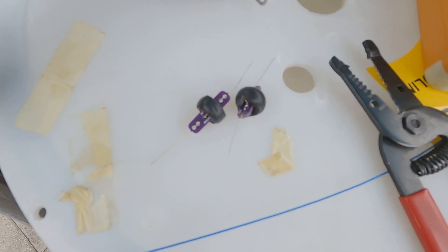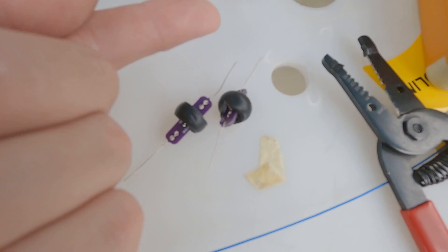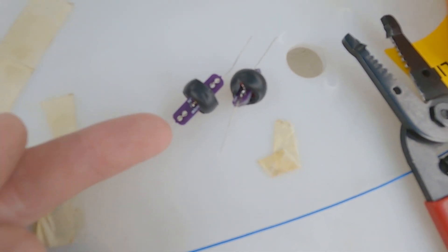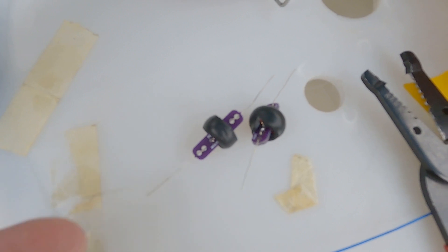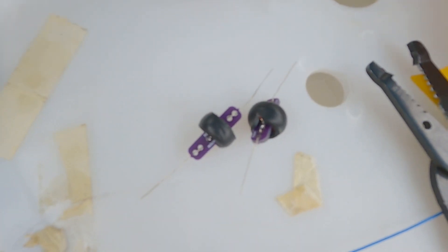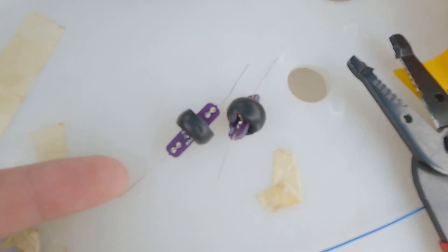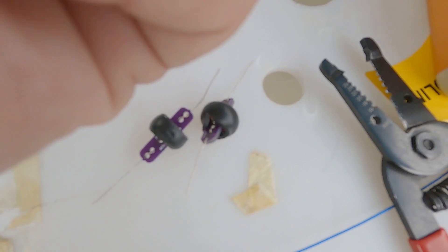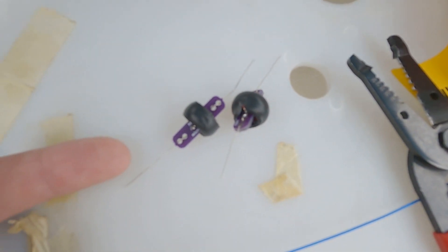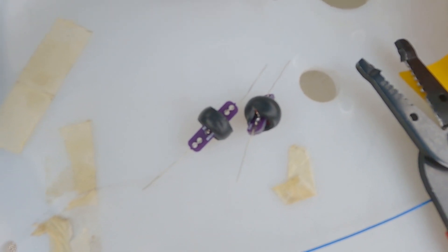The theory is we start with the 20 meter section - the trap should block everything on the other side so we can focus on just making the 20 meter section. But the reality is everything matters when it comes to antennas. So I'm going to start with all of the lengths attached, figuring that any interaction from the length beyond the trap is secondary but still important - better than having nothing there at all.